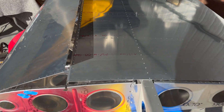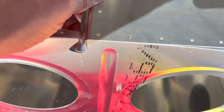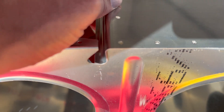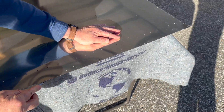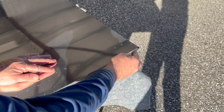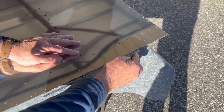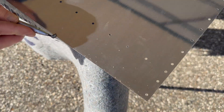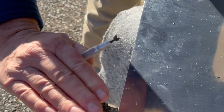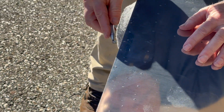We've got the parts laid in place here. It's a very good design, as normal per Van's. See those little cutouts there — the little tab just pops over. You can't really build this wrong. Juan is deburring the edges, the long edges. It's so reflective — fresh aluminum with no oxidization yet. Then we'll hit this with some 220 grit sandpaper on the flat edge and these edges here, without scratching up the face of it.